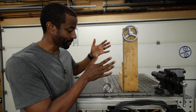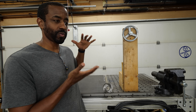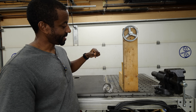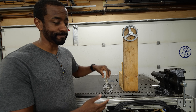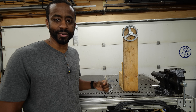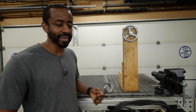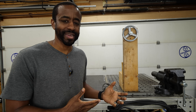For this next tip I need to tell you a quick story. I was designing a machine that was human operated — basically there was a really heavy arm that needed to be adjusted up and down with some regularity and a fair amount of precision. My idea was to use a rack and pinion, except vertical, adjusted by a handle so the worker could crank it and lift the load to exactly where they want it, with a ratchet to keep it from going in reverse. The problem was this thing was so heavy it took way too much force to turn the handle.